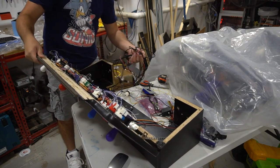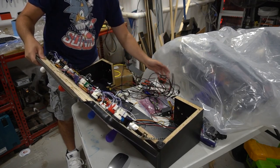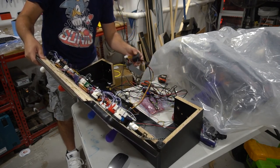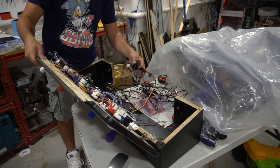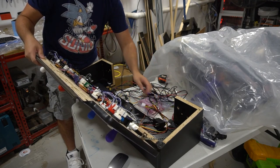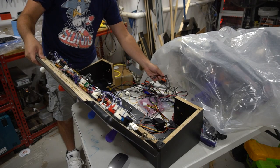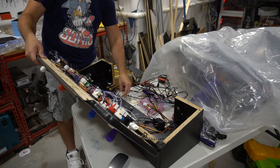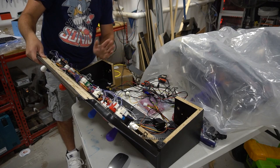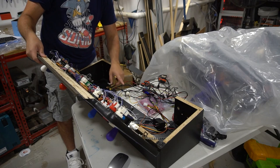So we have a couple of things going on here. You do have a couple of USBs, which you already saw and know. There's a new power cord connector thing to that. And then I do have your regular SATA connection that was going to your PC power supply. And I did add my 12-volt power brick just in case. Again, everything tested. Your connector here that you already have, I rewired it according to how the pictures are. So you do have your individual coin slots: player one coin, player two coin slot is player two. Then you also have the power for your LEDs and stuff.